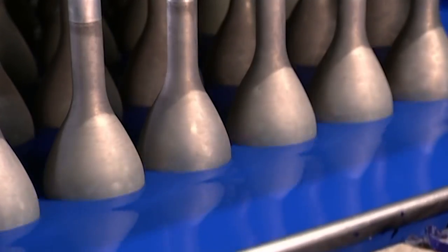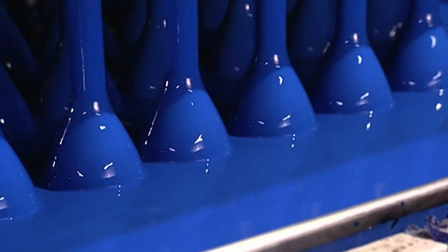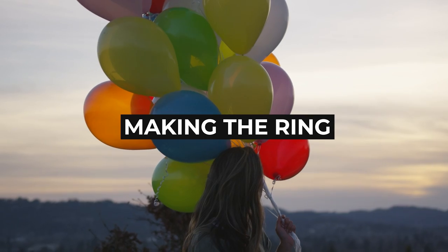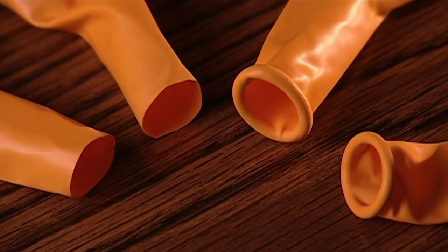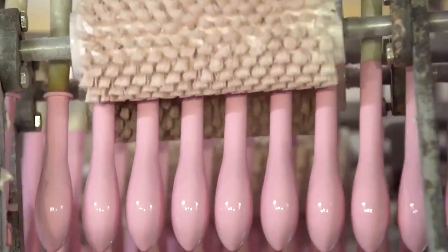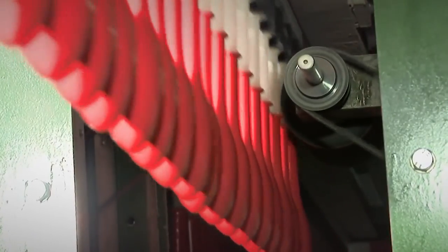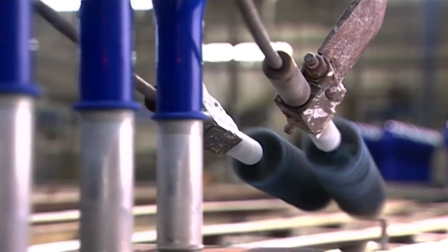This process is also crucial because this is where the most mistakes can happen. As a result, the entire process is done at perfectly controlled speeds to avoid trapping air bubbles and to achieve an even, thin coating. And that brings us to the last manufacturing step — making the ring. While most of us rarely pay attention to it, the most important part of a balloon is the tough rubber lip at the opening. Not only does it serve as the place to hold and blow the balloon, but it also provides additional strength. Once the latex dip molds have just started to dry, the lower stems of the balloon are passed through a pair of upward rotating brushes, which fold the lower end of the balloon upwards into a perfect ring. And since this step is done before fully drying the rubber, the lip actually holds its shape.